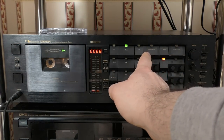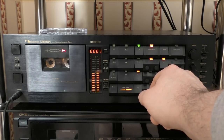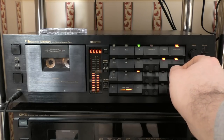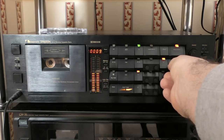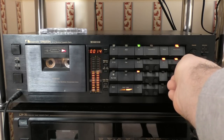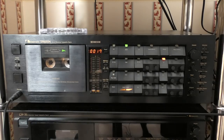The 1996 version. Okay, this is different from the other one — it needs more level on the left, just a smidge. Bias — it's not a million miles away from the other one. But it is within the boundaries of being calibrated, unlike re-slit videotape. So it's not re-slit videotape as far as I can see. Very stable. We could have a goodie here — this could be a super ferric, maybe cobalt doped. Let's play some music through it. This one is also from the YouTube Audio Library — it's called 'Disco Funk.'